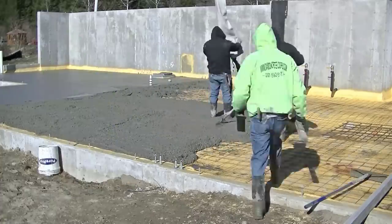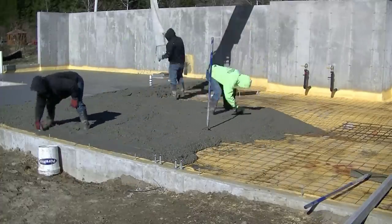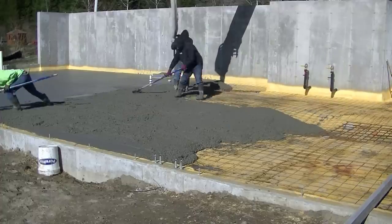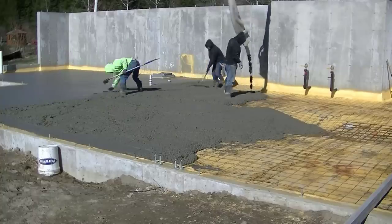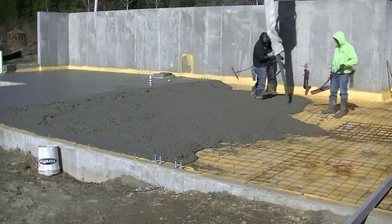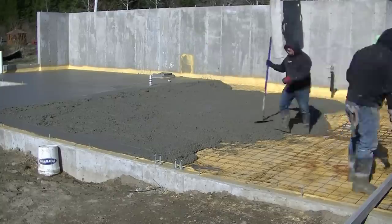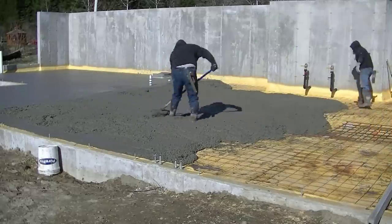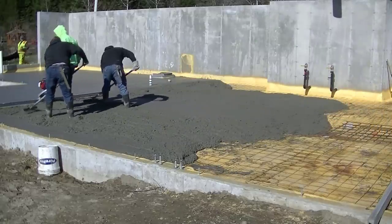I've got my grade stick in here. I use a Topcon RL-H5B self-leveling laser when I'm shooting my pads in. Those wet pads I'm making in the middle are the same height as the top of that concrete wall right here in front. We're making this floor perfectly level and we use a laser and wet pads to do that. In something like this, we don't set grade pins, we don't have a screed board — we've been taught to wet screed and that's what we do.